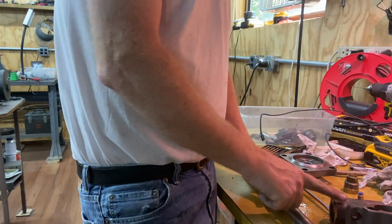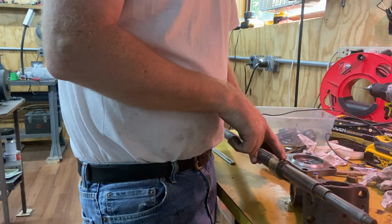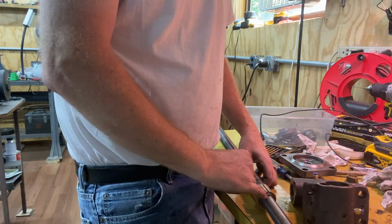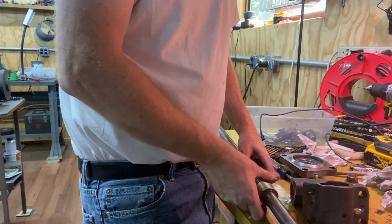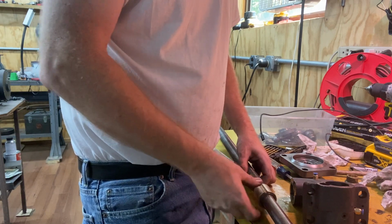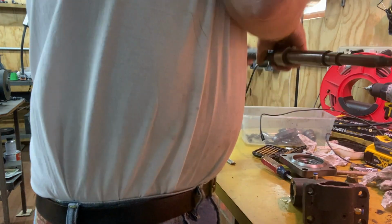Okay, I don't remember now how I did this other one. I've got the first nut in here for the x-axis, and now I need to slide this one in, and it's got a mate. And I first tried it so that I could see exactly two threads, and that did not go in far enough. So now I'm going to make it so I can see just one thread. And actually it'll be one thread in the start, right at the start of the other one. And let's see how those two go together.